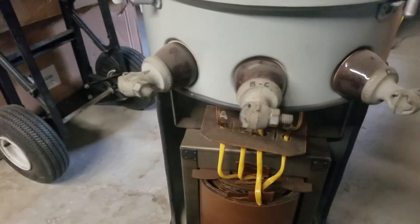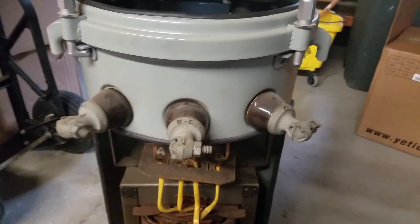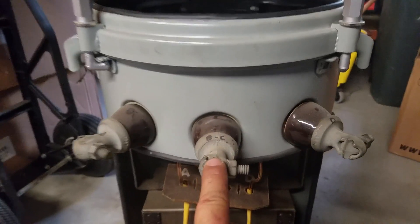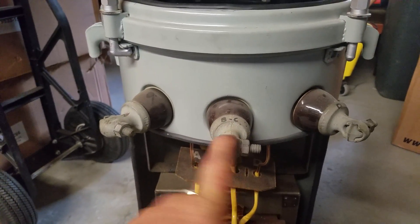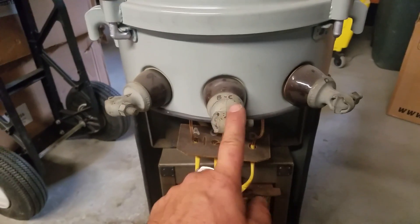Going to your home, you have an ordinary twisted pair aerial drop — twisted pair with a neutral. Hot leg on one side, hot leg here, neutral in the center. It runs all the way to your home. This is also grounded down at the base of the pole with your down ground. Usually you'll see one or two ground rods, supposed to be two ground rods within six feet of the base of the pole. This is connected to that.